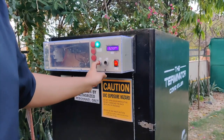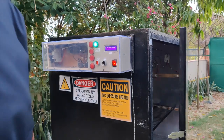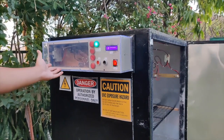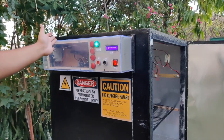Once I press the start button, the machine begins to do its thing. What happens if you open the door while it's running? A relay trips, the safety light comes on, and the lights turn off. What happens if some of the wiring comes undone? The same relay trips and the lights turn off. What happens if there's a short circuit? The MCB trips and the lights turn off.